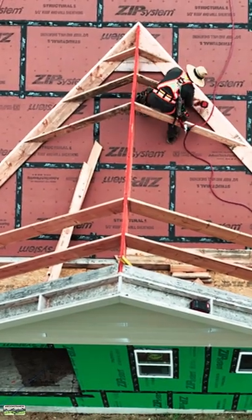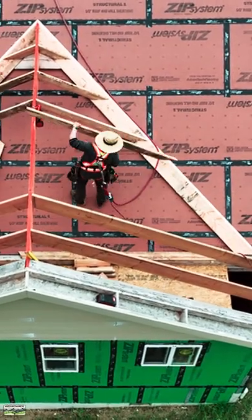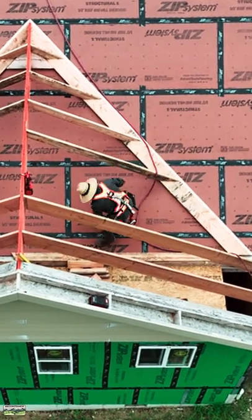Here are the details: 2x12 sleeper valleys. They're beveled because I think that's cool. They're 2x12s because it allows for more nails valley to the rafters below, as per our engineer.